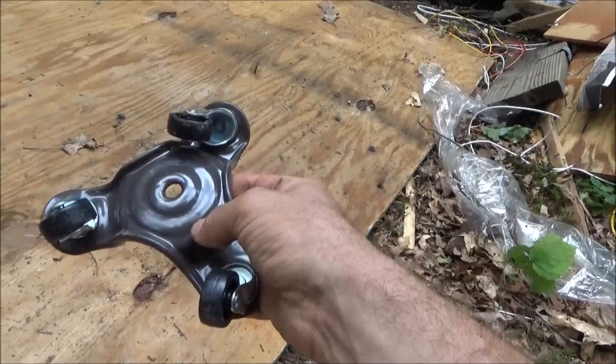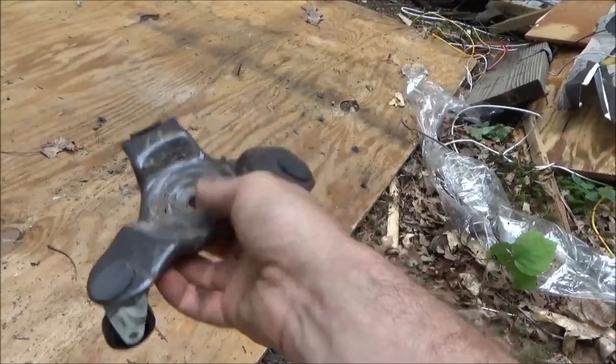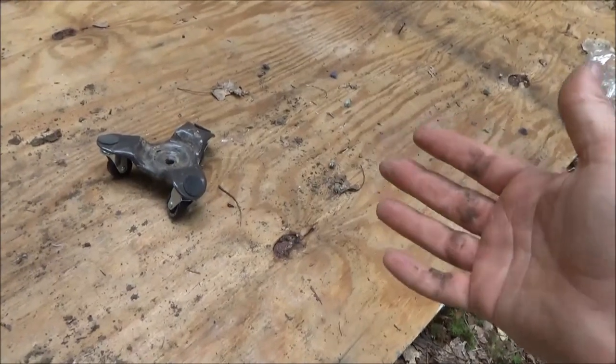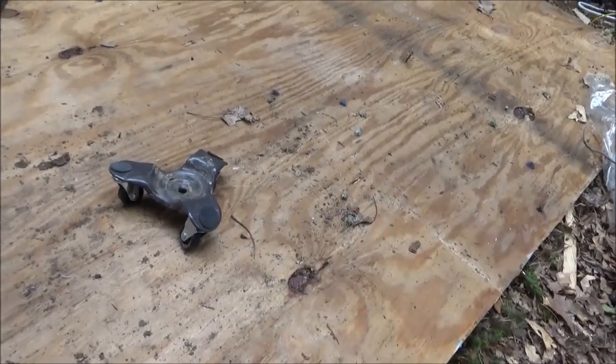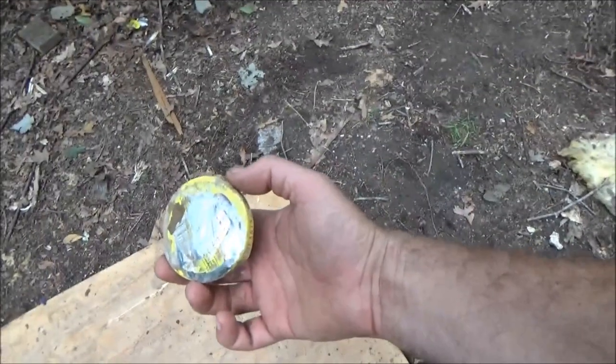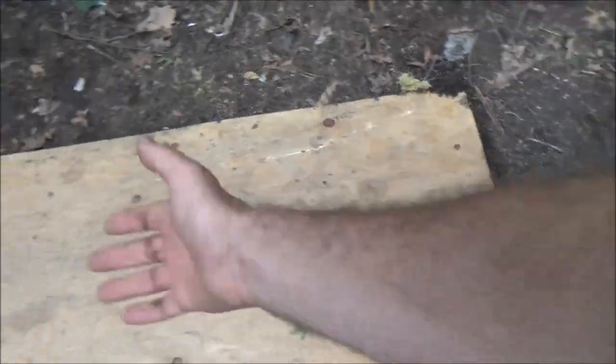It was supposed to have a 200 pound or so capacity. And normally it should have managed. I mean, all it was doing was rolling. But what would happen is that would catch on the ground and then it ripped the wheels. So what we ended up doing, simplest thing in the world, a lid from a food jar, put it on there, put the jack on there and slid it along the board using the tractor and a chain to maneuver this thing.